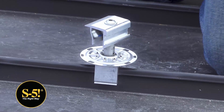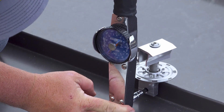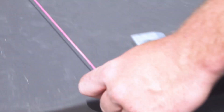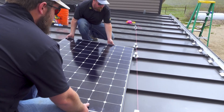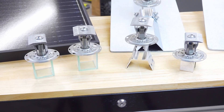They didn't have to change modules or use adhesives or do anything outside of the strictest building code regulations. PVKit itself is really a one-size-fits-all — it works on traditional module frames all the way from 30 millimeters up to 46 millimeters. The roof attachment that PVKit pairs with, though, is going to be very specific to the metal roof itself. For any company which offers you a one-size-fits-all standing seam clamp, they're leaving some benefit off the table. The clamp is either going to be too big, not fit well, not offer optimal holding strength, or cost too much — usually multiple things. By taking the few extra seconds to talk to S5 and figure out what clamp is best for your roof and application, you're going to get the best of all those worlds and not be overpaying.